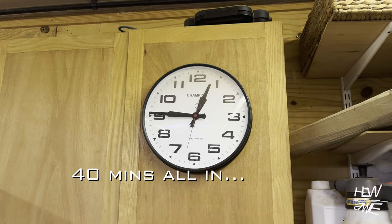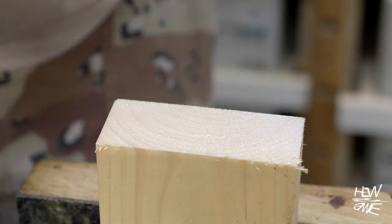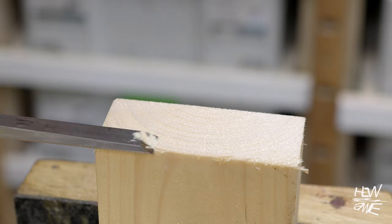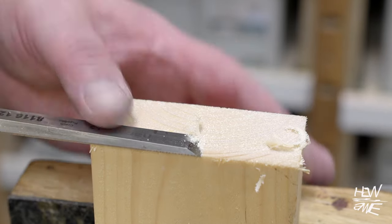Finishing off with the 8000 grit stone, it's no mirror for sure, but it's sharp enough to unzip a person with ease. I don't know, I did it to myself once. When I'm rich and famous, I'll get the 16000 stone and finish off with that. There's absolutely no denying it cuts way better without a secondary bevel. Try it for yourself and feel how easy it is.